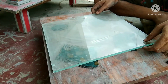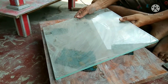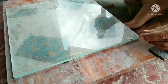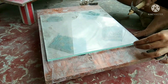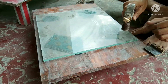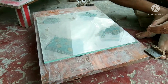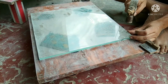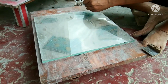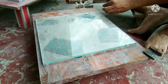This is an 8mm thick plate glass from which I will cut a 12-inch diameter mirror blank, which is not recommended. For a 12-inch diameter mirror blank you should have at least 19mm thick plate glass — 25mm is recommended. But I did not find 25mm or 19mm thick plate glass in my local hardware shop, so I am going to experiment with an 8mm thick mirror blank to see the result.